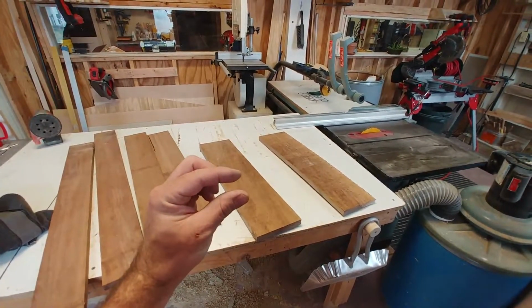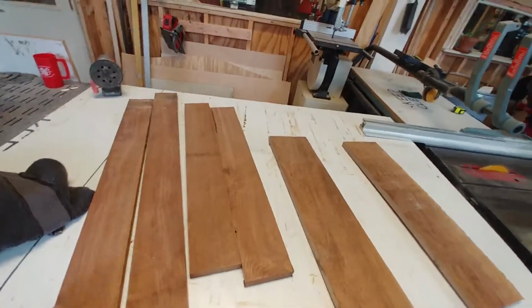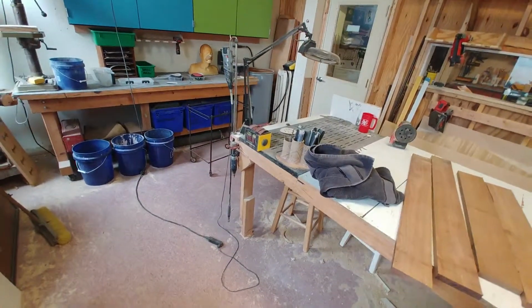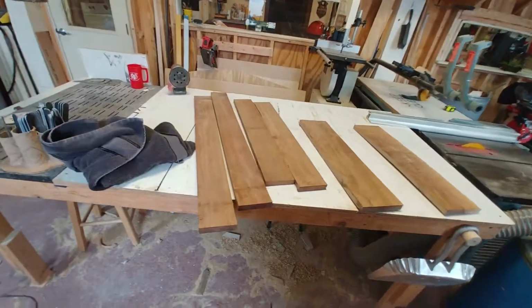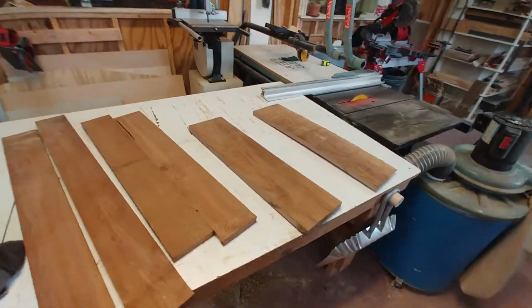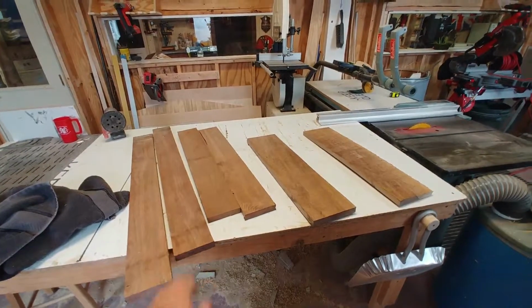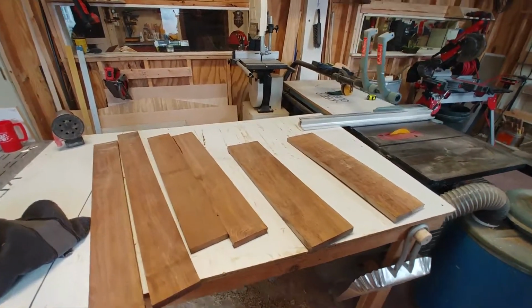So then you end up with a panel that's, you know, 1/2 inch thick or even 5/8, and after 5/8 thick with real hardwood, it starts to become a weird aesthetic. It's nice if you can keep hardwood 3/4 inch thick or greater. It's just odd to see it much thinner than that. Becomes more of a sculptural piece. So since this is an inch still, or just a little shy, we're going to try not to lose more than a 1/16 of an inch, maybe 3/32 at most.